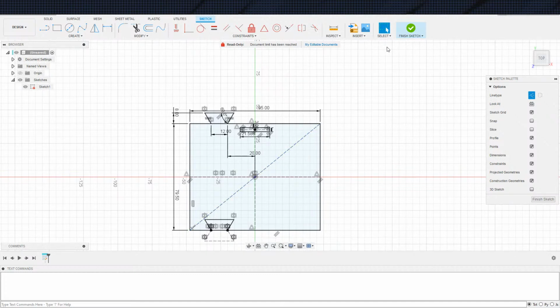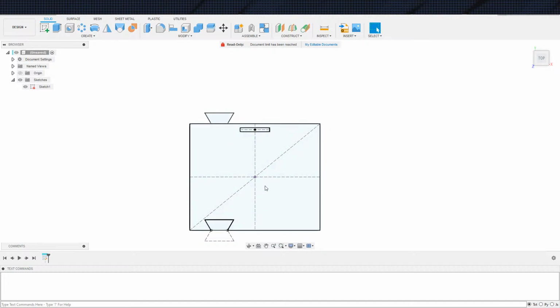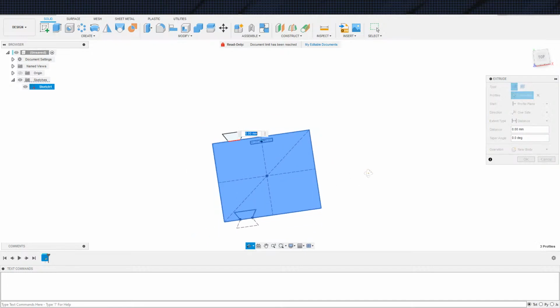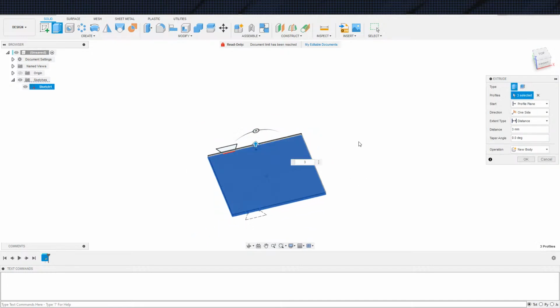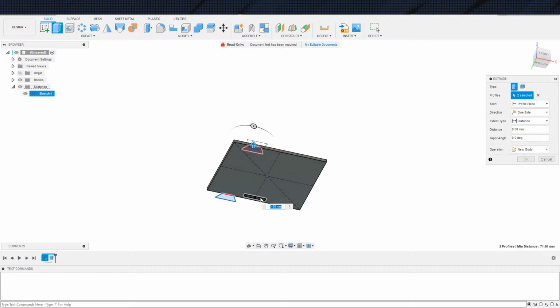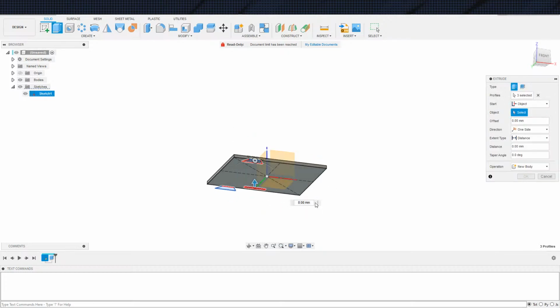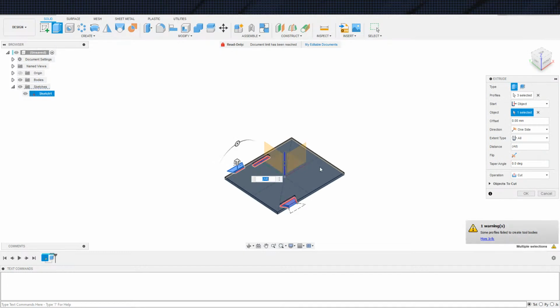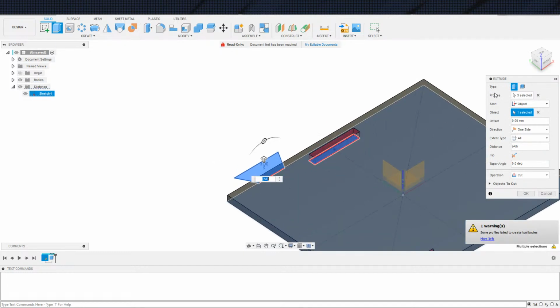And now we will extrude, and then I'll just mirror the features over. So extrude this and then mirror the features. Doesn't have to be super thick. I mean, heck, we could call it 2 millimeters if we want to. I'll go with 3 millimeters anyway. And now mirror the features. We want that, that, and that. From object, distance, all. Oh, that's right. I can only do one operation at a time. That makes sense.